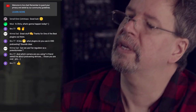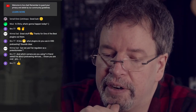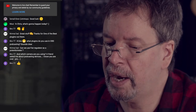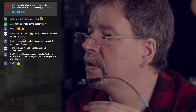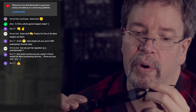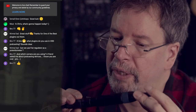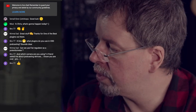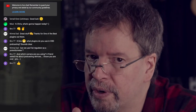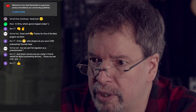So the clarity of the sound is this little microphone or my good microphone, which you see on the plugin posting videos, and it's going through a, here, that's visible, Sennheiser MZA 900P, which I'm trying to hold in shot, which is a phantom-powered lavalier microphone powerer. So this works fairly well. And it's being powered and going to a preamp, which is an API 3124 Plus. Those are expensive. That's why it sounds good. There is no processing after that. So there are no plugins. There is no processing. That's part of the secret to doing this kind of stuff.